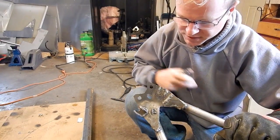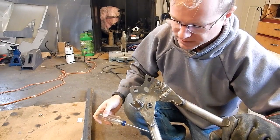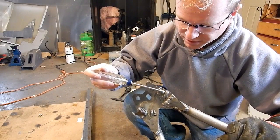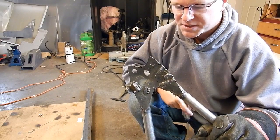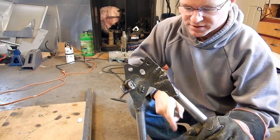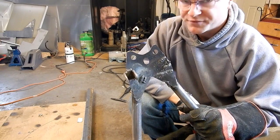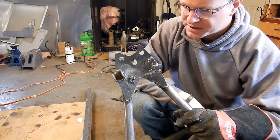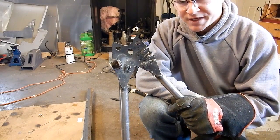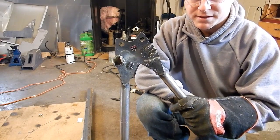I had to get this up to 140 amps to run a continuous arc, which is always a little bit too hot. I managed to run it at about 115 on the indicator. The package says 80 to 100 amps for these rods, but I think the current setting on that welder is not very accurate. I was able to run it on eighth-inch mild steel, which on AC at that current setting would just blow right through — so this is obviously a little bit more of a positive outcome.